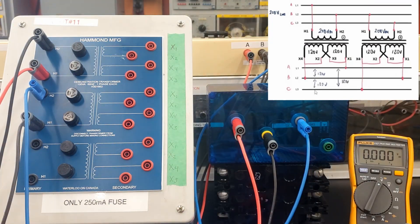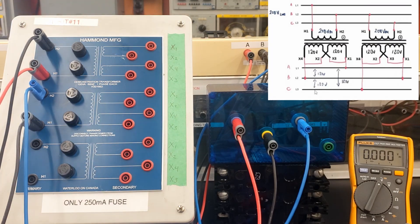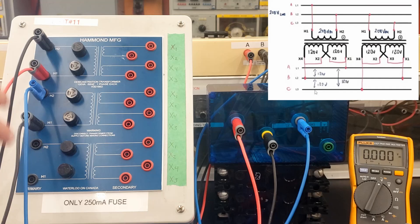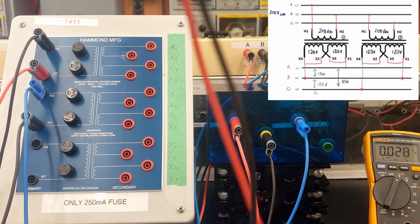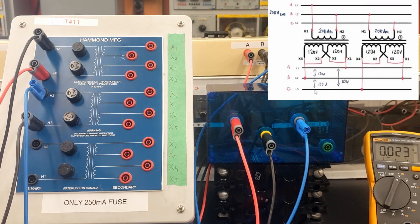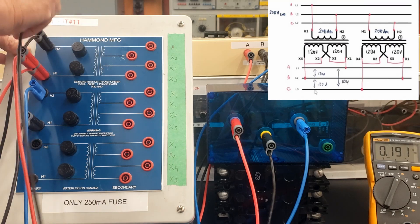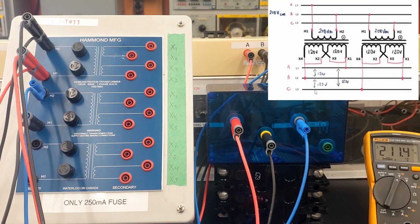At that point you're more than welcome to liven it up, see if the breaker holds. So that looks good — I know that there's no issue on my primary. Looking at the voltages on those guys, let's take a look at that before we move on. The voltage on each of them should be identical. So looking at the voltage on this primary right here,